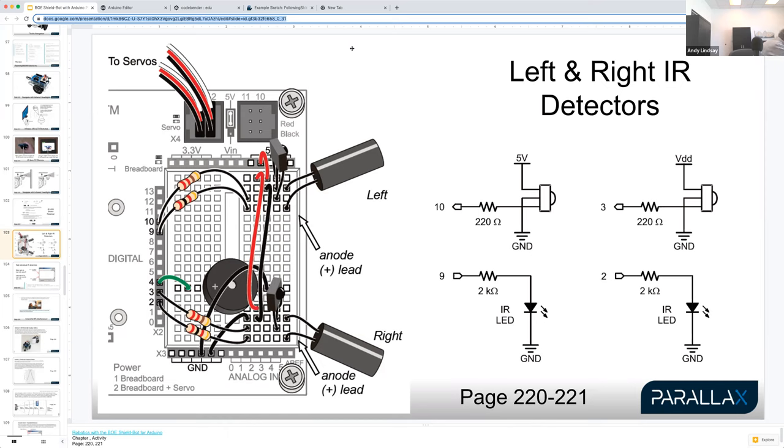You'll see some resistors that are taped together. The red, black, red, and the red, red, brown were both loose in the package. And all of them are going to have a fourth gold stripe. So I'm just calling out the stripes that are not gold. Make sure to retighten the front standoffs after you've unhooked the whiskers from them. You just loosen the screw a little, unhook the whisker, and then retighten.